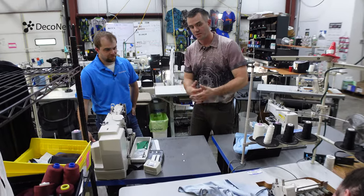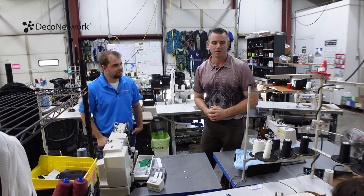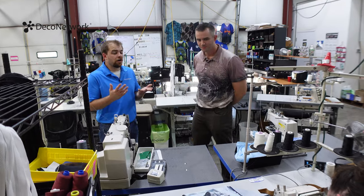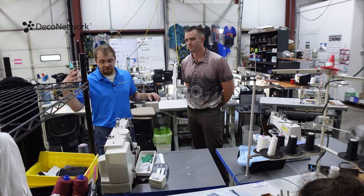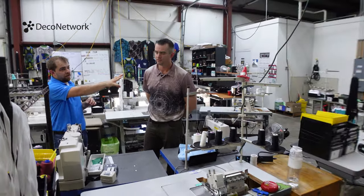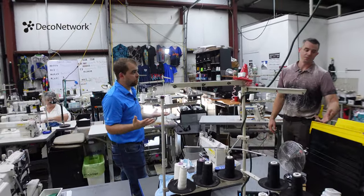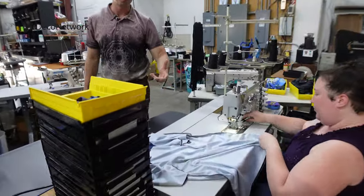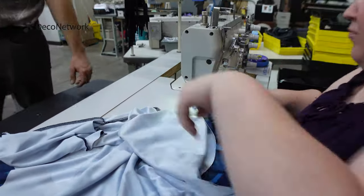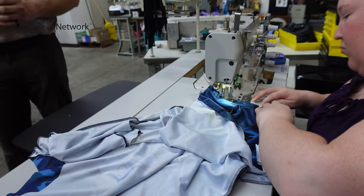We're just doing step one of the sewing process here, the serge. We also have to hem, and we also have to do a couple other finish techniques on it. I'm not saying this is how you ever want to run it, but you could go from completely raw materials, nothing has been printed, you have the artwork, to printing the transfer, heat pressing it to marry it to the substrate, cutting it, and then sewing it, in less than an hour, technically. We've had those rare instances where a critical customer has called in the morning, saying, hey, I need 4 to 6 of these overnight, and with the process being digital, we can go all the way from the digital computer screen, step one, to the finished sewing.